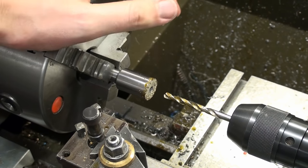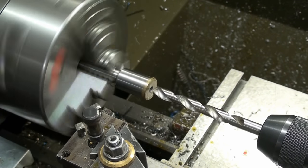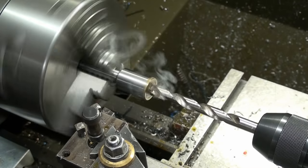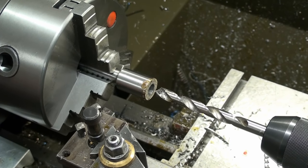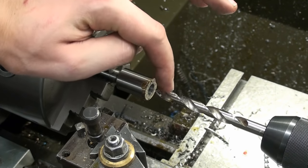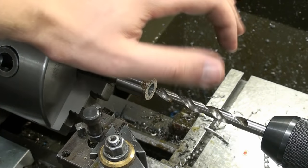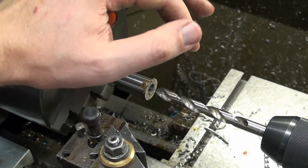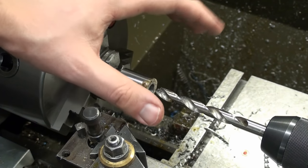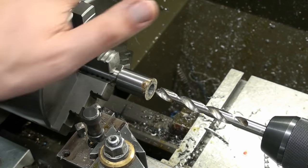We drilled in 25 mm. Now we open up the hole to 9 mm, then we'll bore it to 10 mm to give it a nice, accurate bore. I don't care much that there's almost only one chip in the flutes of the drill — for me a drill bit is a totally absolute roughing tool, nothing more. They are good for bolt holes, but if I need anything more precise I need at least a reamer, or go back and single-point bore it, which is the most precise way to create a round, on-position hole.